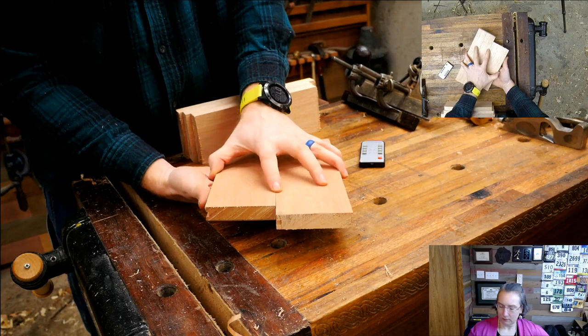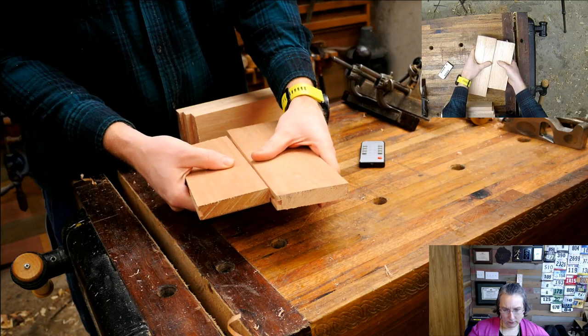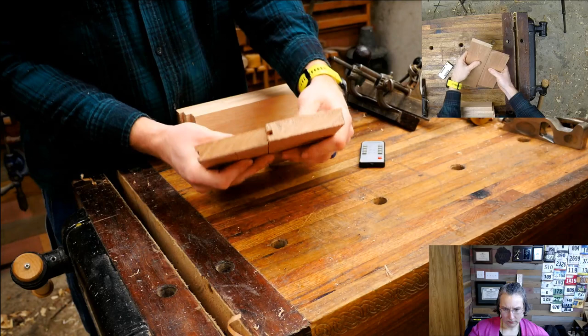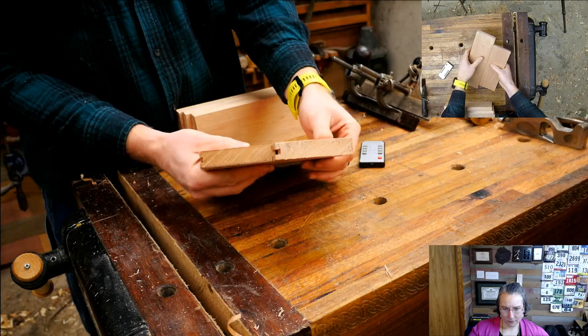They don't provide a whole lot of strength in the joint, as the glue actually provides an incredible amount. But for something like flooring, where you do want a little bit of movement as expansion and contraction happens, the tongue and groove is great for this. So you often see this in places like the backs of dressers, or doing joinery edge to edge, or doing panels and things like that. This is a fairly common way to connect two boards together like that.